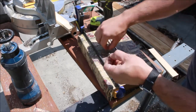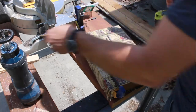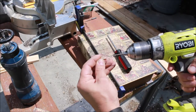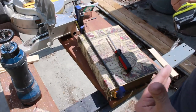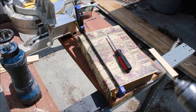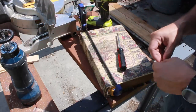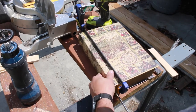I've got my screws and my drill bit to make a pilot hole. You have to make sure your pilot hole is about the thickness of the rod down the center of the screw. The flange of the screw needs to be wider than your pilot hole — that way you're relieving the pressure on the wood so it doesn't split, while allowing those threads to engage with the wood and drive in without splitting. I went all the way through the wood into the center of the book to get full depth and full grab with these little screws.